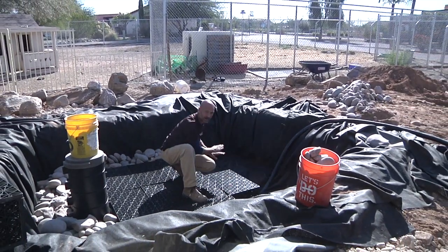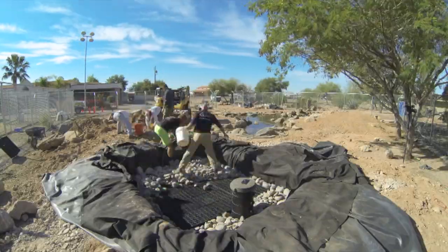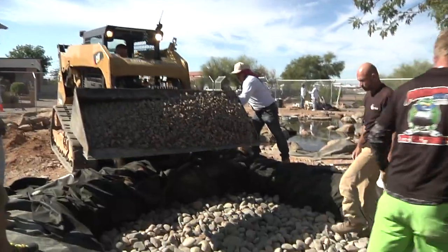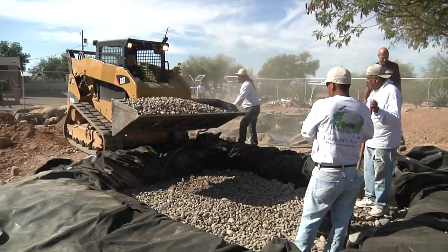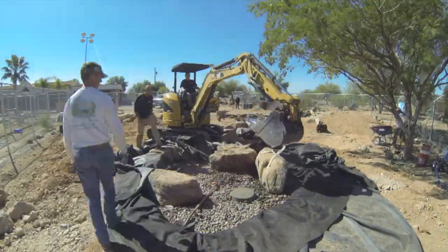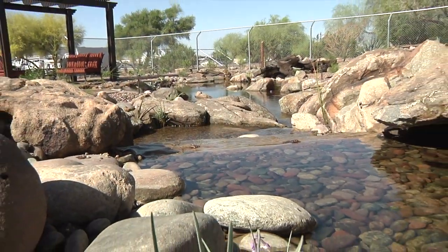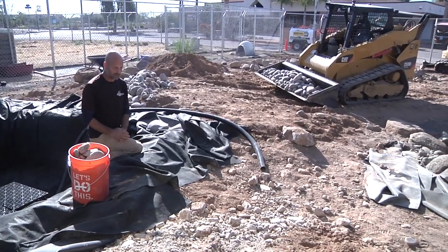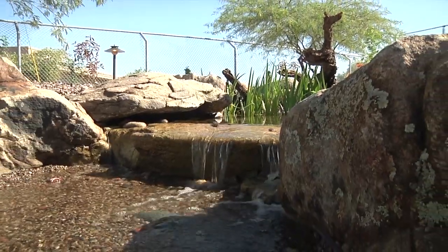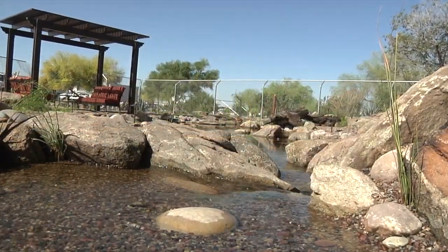Our next step is to continue our layer of aqua blocks along the bottom, then cover everything with large river rock. I like using large river rock first because it continues to spread the water out. We'll do approximately eight inches, then come in with smaller gravel — inch and a half to two inch — and finish with three-quarter inch. So there will be multiple levels of different gravels, then finish off the outside perimeter with decorative stonework. The final piece is cutting a waterfall right out of here to connect the water back into our pond. The waterfall is critical because as that water comes out, it increases dissolved oxygen — and the biological activity in our wetland filter consumes lots of oxygen, so we want to re-add that oxygen through the waterfall back into our system.